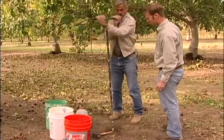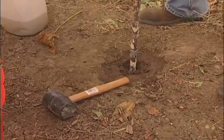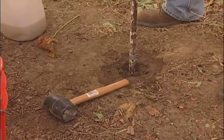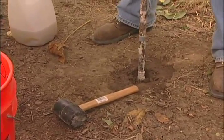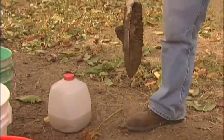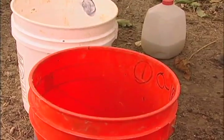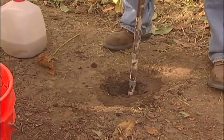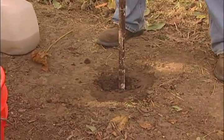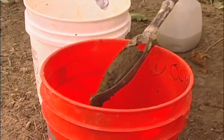Go back into the hole. Now your auger's probably filled up at this point. Give it another little twist as you pull out, and keep your chin back because I've busted my chin more times than I can remember. Knock that into our number one bucket. This next time you're going to be able to go down to the edge of your tape and that'll finish our first depth. Pull that out, knock that out, and then we grab the second depth.